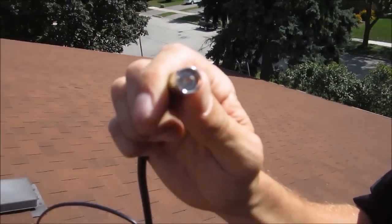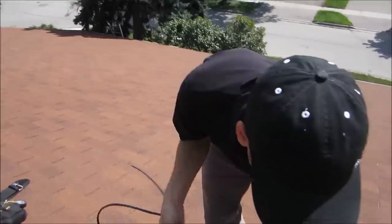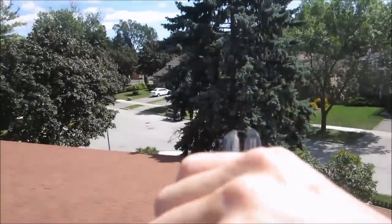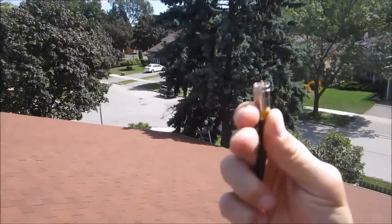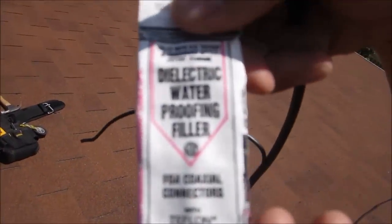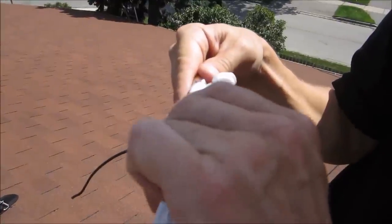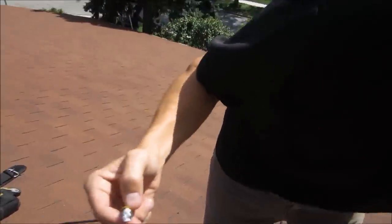You can see the copper and the white — you want to make sure there are no ground filaments touching the center copper conductor. I also like to trim the copper if it's too long, just cutting it to a proper length. We also put dielectric grease for coaxial connectors with Teflon on the connection — this helps seal it so water and moisture can't get in and cause the system to stop working. Just put a little bit of that grease in there, then connect it to the antenna.